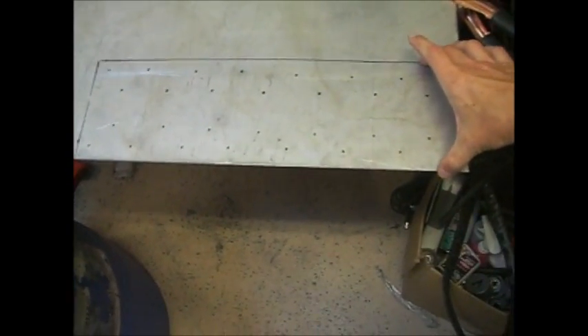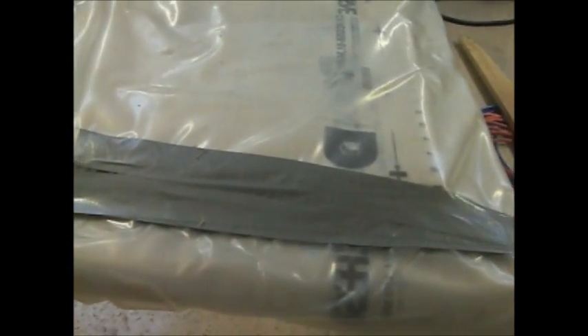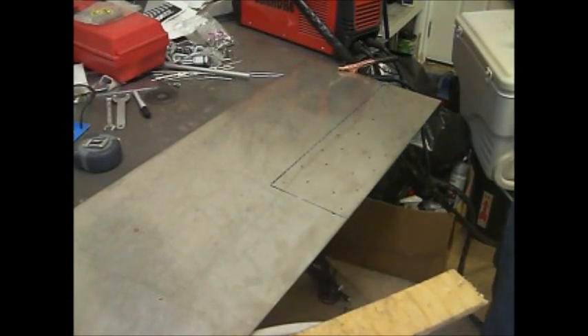We're going to use a plasma cutter to cut this stainless plate, which is about two millimeters thick - maybe one sixteenth of an inch. It's going to be six inches by 20 inches, and all these holes are for screws to mount it. It's basically going to hold two big slabs of maple that are part of a bathroom countertop, with the plate in the middle underneath holding both pieces together. Let's start cutting at 42 amps and see how well that works.